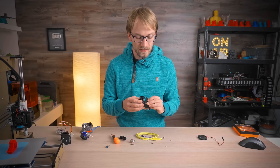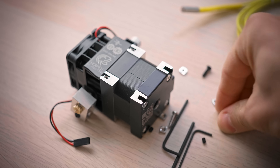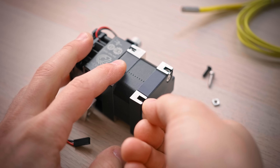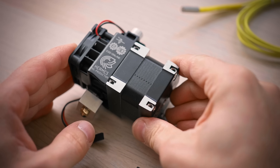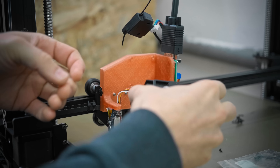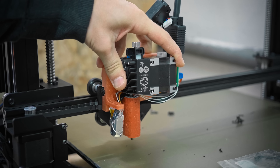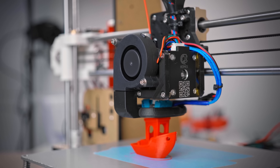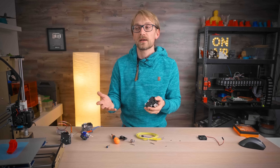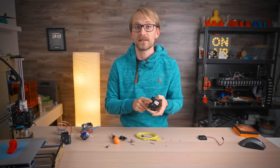When it comes to mounting it to your specific printer, you get M3 nuts on two sides of the Hemera — for most printers that works really well. I've made mounts for the Raptor 2.0 and for the Anet A8, and there are mounts for a ton of other printers already available, thanks to E3D reaching out and sponsoring people to create these mounts and full mod guides. The Anet A8 guide I did was also sponsored, but this review right here is entirely my own experience with and my opinion on the Hemera.